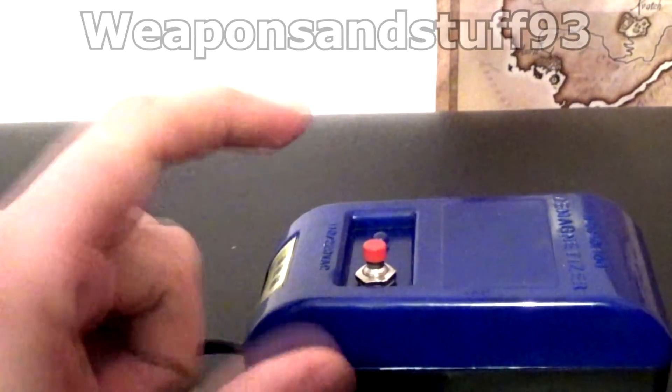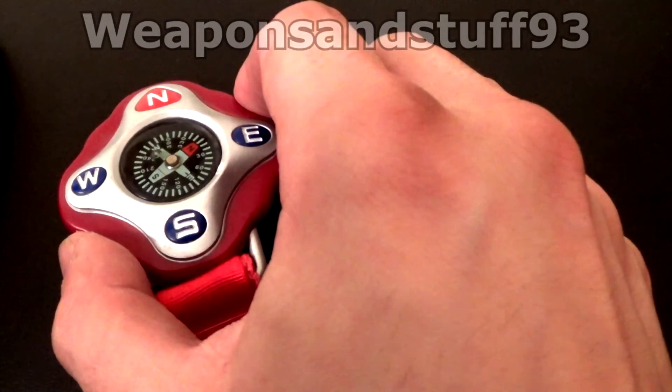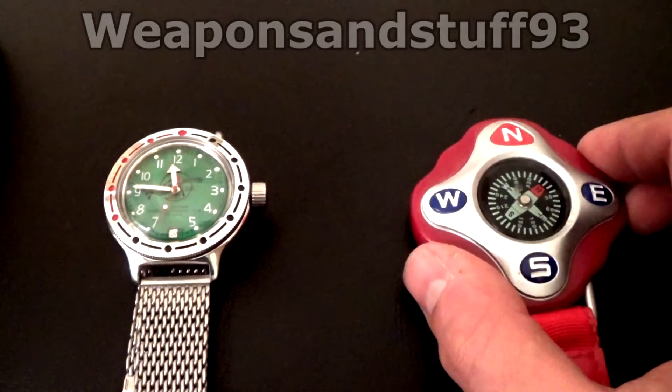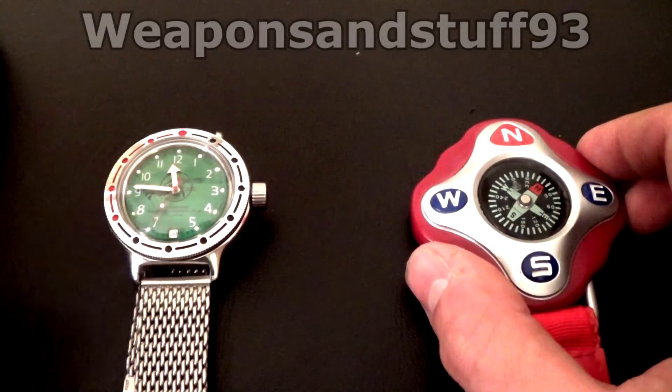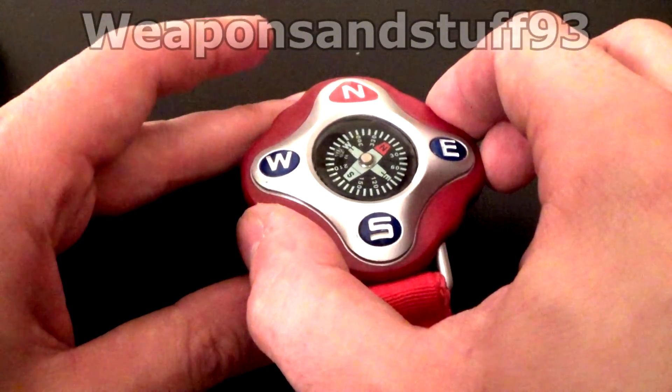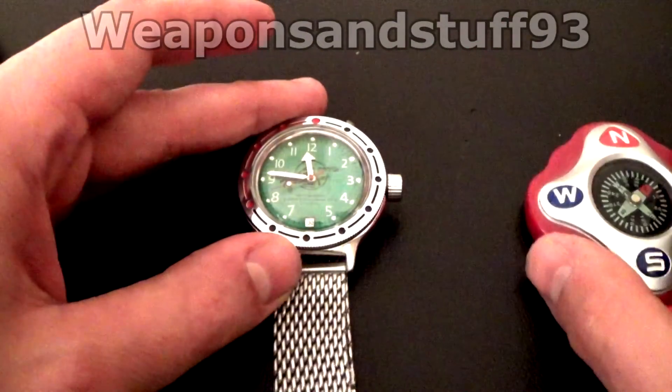The mechanical insides of the watch won't be magnetized anymore, so they should run far more efficiently. You'll see that when the compass is placed back onto the watch it barely moves. You can repeat this process with the watch facing both ways to even more efficiently demagnetize it, and it will now tell the time far more accurately.